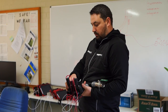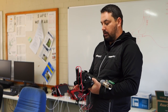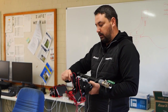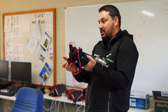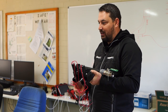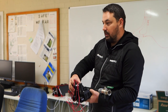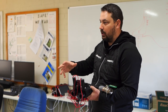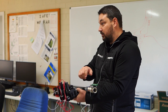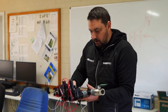As Scott was saying, if this valve fails and it was a PVC-built system, you can't spin it because you'd hit the next valve. People tend to have to take the coil off, take the bonnet off so only the body remains and allows it to spin, and still have to dig around gravel or concrete pavers. Whereas with this system we just undo the collar, cut the poly pipe on this side, lift the whole valve out, deal with what we need to, put it straight back in - and all the other valves haven't been disturbed at all. Just remember to turn the water off first because as soon as you undo it, water will come out.